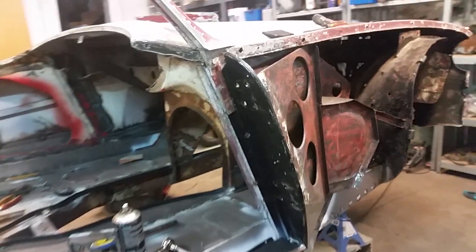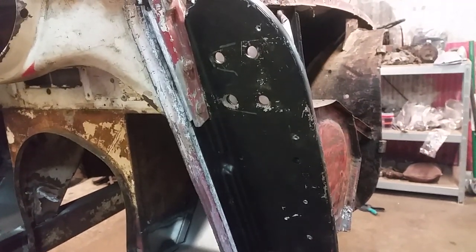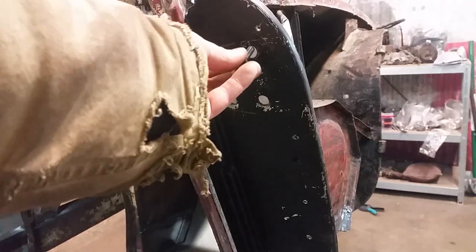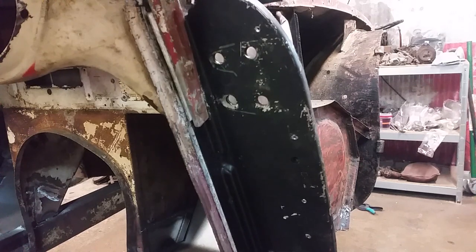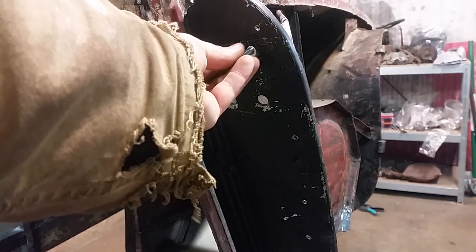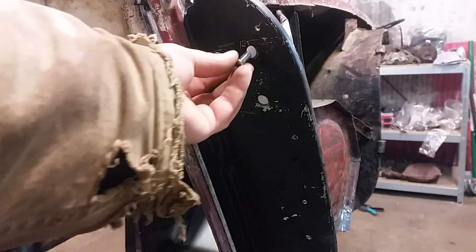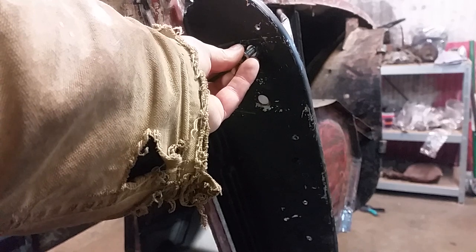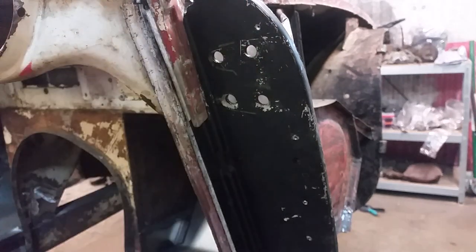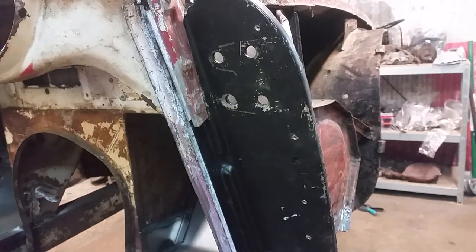So on these door pillars, they have these holes, which the door hinges screw into, and they're bigger. It screws into this plate, which is on the back. And this allows you to adjust the hinge up and down, back and forth. Problem is, I keep running into the edge. There's not quite enough adjustment in them to put the door exactly where I want.